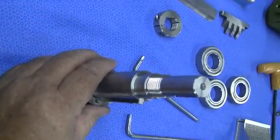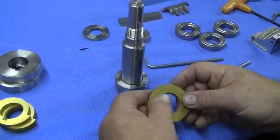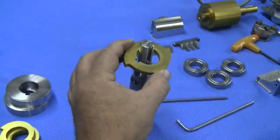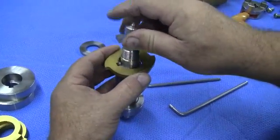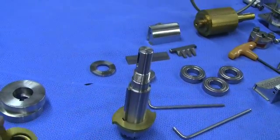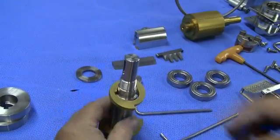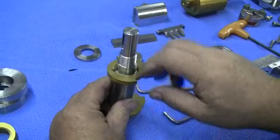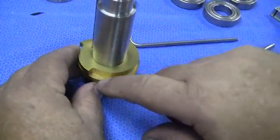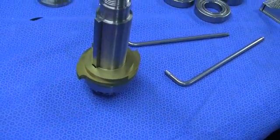Just remember that the cutting edge is always going to be on your left whenever you stack these blades up. And you start with the large blade. So you start by the key on the left, cutting edge is on the left, and just start your stack by every other one. So you go one of the big blades and one of the small ones. Again, making sure that the cutting blade lines up with that relief on the small ones. The large one, always on the cutting edge, is always on your left.